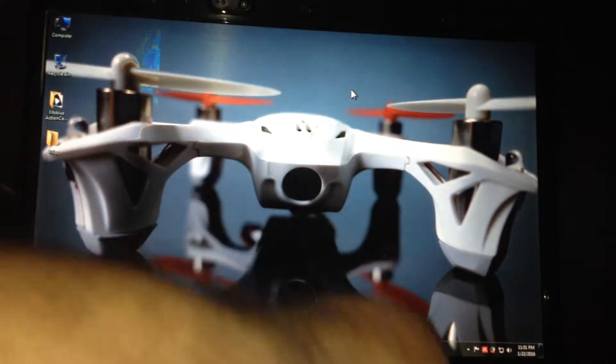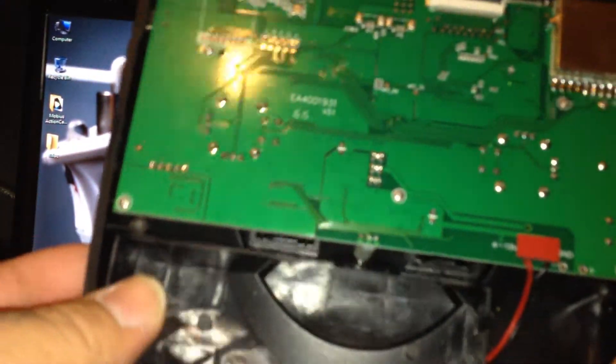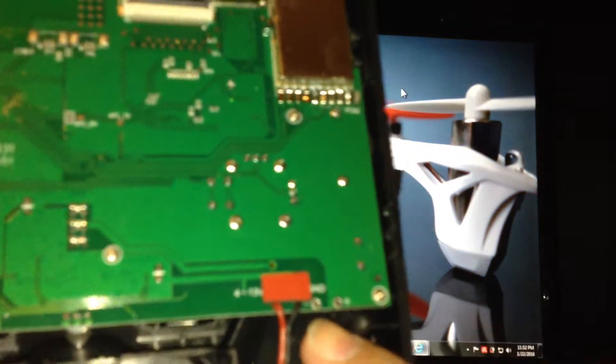The purpose of this video is for another mod. You saw that first mod on the connector — I saw this on YouTube and gave it a shot. Everybody's taking the controller apart with the screen and putting LiPo batteries in it. I changed the connector. Without a voltage regulator, you can put a 7.4 volt LiPo on this — it says 4 to 13 volts right there on the board, and over here it says GND for ground. Some versions of this board will just say 6 volts, but people have put a 7.4 volt LiPo on here, just changing the connector, and it works fine. You don't need a voltage regulator.